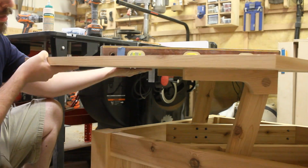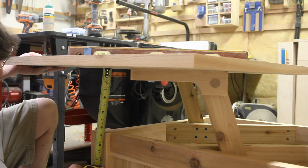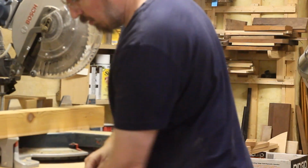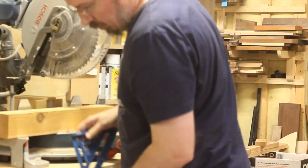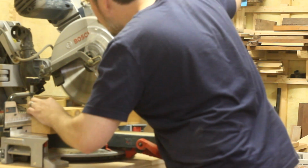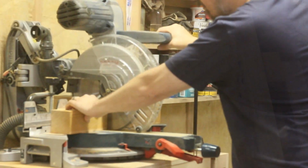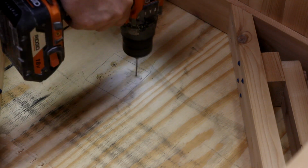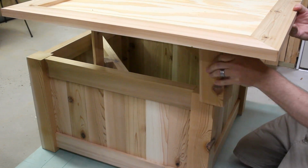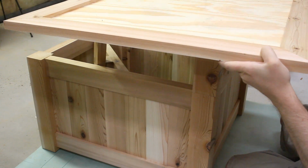Now I needed to figure out how long to make the support post. That'll hold the surface securely and at the right height to keep things level. I grabbed the remaining piece of 4x4, cut that to length over at the miter station. I traced the location where it needed to be on the underside of the table, and then piloted 4 holes through the table base so that I could see them from the other side. Then, by adding some glue and positioning the tabletop within the traced lines, I could drive the screws in from the top and secure it into place.